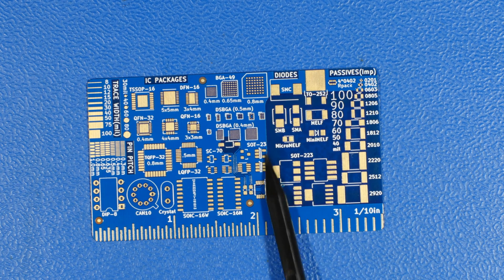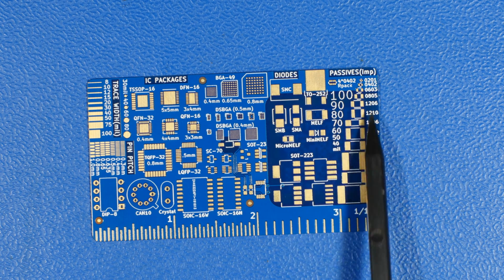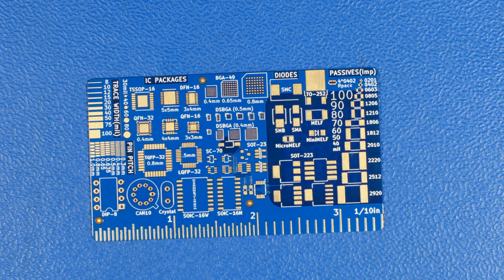That curved contrasty bit is a copper pour keep-out region around the NFC coil. In order to preserve the permittivity of that portion of the card, the internal copper layers had to be pulled back to reduce interference between the coil and the neighboring copper structures. This ensures a magnetic flux between the coil in the phone and a coil in the business card. Of course, there are still a bunch of smaller copper pads on the back, partially mitigating this design practice.